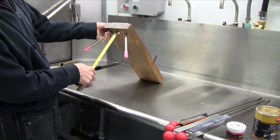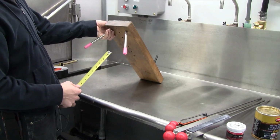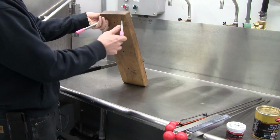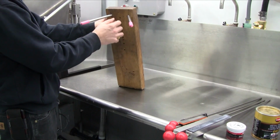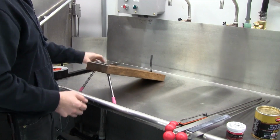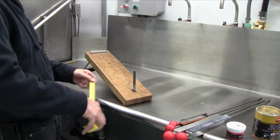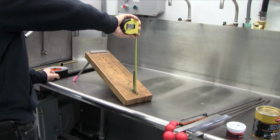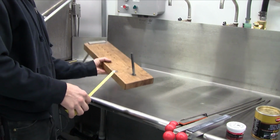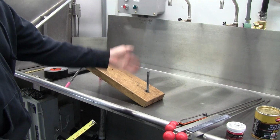Again, I'm probably at a 30 degree angle, and there's 7 1/4 inch plus they go in the wood, so it's a little bit tricky to drill your hole at an angle like that. That's what I found challenging a little bit. So what I did is I drilled my hole slightly oversized, and then I put some 5-minute epoxy glue on there, so then I can put it at the angle that I want. This is just a 1/2 inch threaded rod, and it's 4 1/2 inches long, plus whatever. I think I went about 3/4 inch deep in the wood. Again, I had to drill my hole here on an angle, so when it's sitting on a table, it's 90-degree vertical.